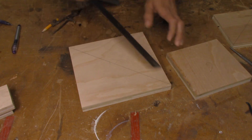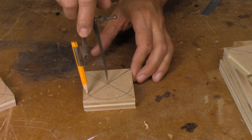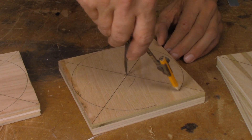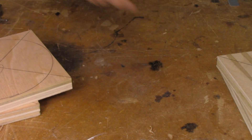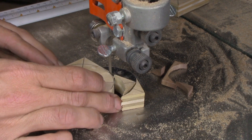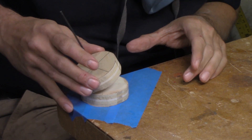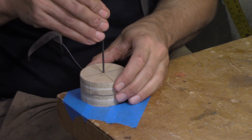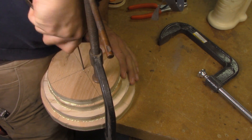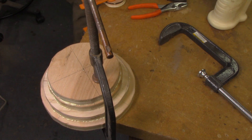Find the center of each of your pieces and drill out a small hole on the drill press. Lay out your circles with a compass based on whatever size pulleys you need. For each of my pulleys, I add a half an inch to the diameter to give a little bit of wiggle room during turning, so if I make a tiny mistake it's not going to be a catastrophe. Rough out your circles with a bandsaw or jigsaw, but be really careful to stay outside your lines. For glue-up I used regular Titebond — it's plenty strong enough. To keep everything lined up, I pushed a drill bit through those little holes I drilled earlier. I also wax the drill bit and yank it out as soon as everything is clamped down so it can't get stuck after the glue dries. I let the assemblies dry overnight for maximum hardness.